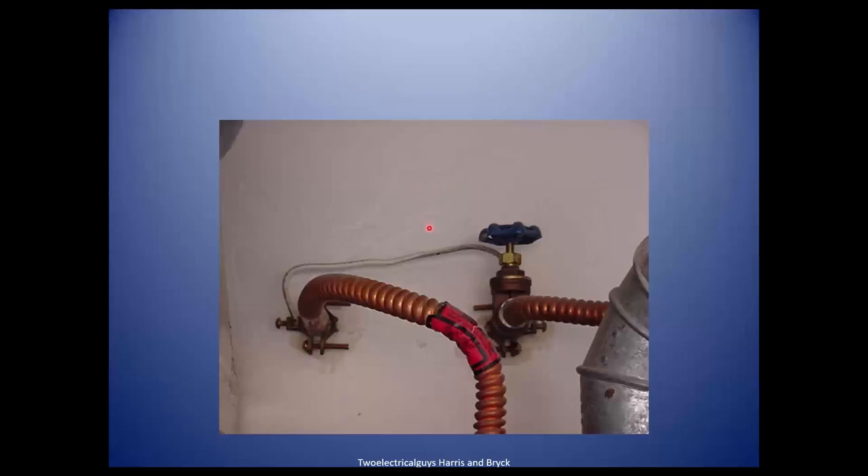There's also a plate behind the wall if built correctly — it's a nailing plate that takes up the bonding path. If you have copper behind the wall, there's a plate that makes that path. We don't know what's there unless we cut a hole in the wall — that's another revenue opportunity to cut it open and figure out what kind of piping you have.